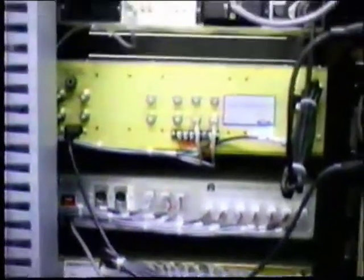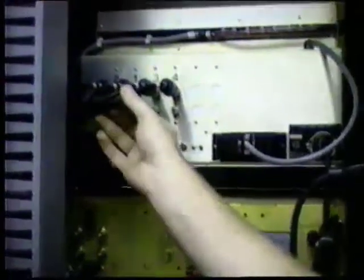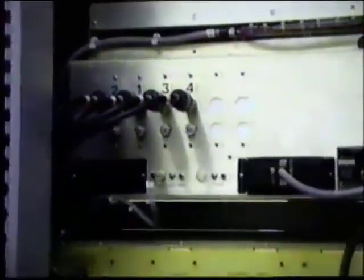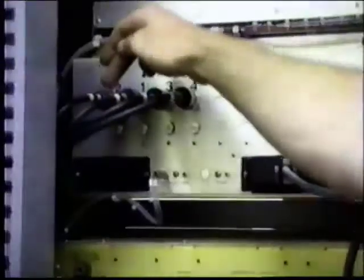That's fine. Okay. Now you'll notice that the antenna monitor has these coaxial cables that are actually all cut to the same length. And they're actually numbered as to which tower they are. That's right. And the numbering is out of sequence because the antenna monitor requires that the reference tower be presented on this input port. And the antenna system design requires that tower 2 be the reference tower. So we had to swap the numbers and the coaxes around to make everything look 1, 2, 3, 4 on the front panel, so it went in order. And that's pretty much all that's back here, except for this telephone terminal. I'll get out of your way.